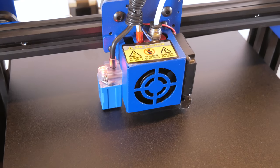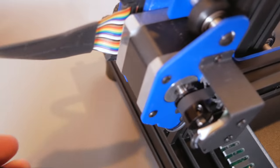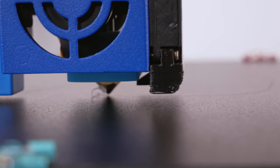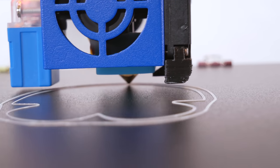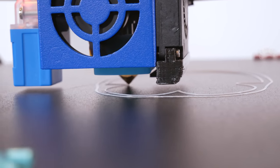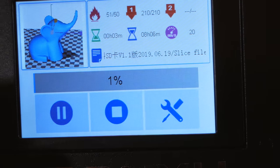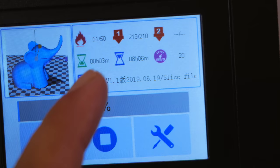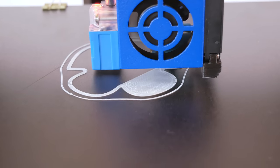We're too close to the bed so I stop it quickly. I notice this printer has no Z-axis end stop switch — it appears to use the leveling sensor as the switch as well, which is interesting. After re-adjusting the Z offset and restarting, it looks right. The first layer looks okay — could go down just a tiny bit more but it'll be fine. It's going to be a long print — the estimate says 8 hours and 6 minutes.